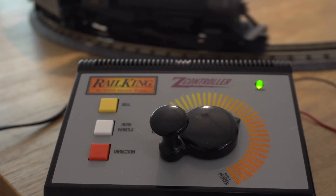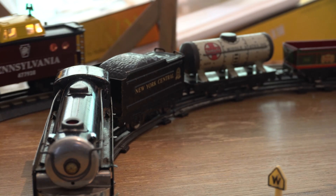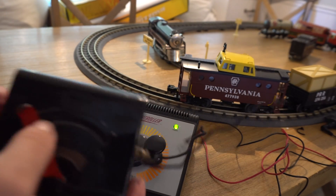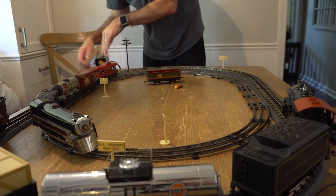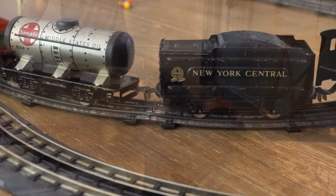Let's try the 1950s train. Does it work? It uses the basic same principle as the other train — a voltage transformer that goes through the tracks to the locomotive. In this case, it's just a motor in the locomotive. There's a light. This 50s train is more dangerous; the wiring standards of the 1950s were not what they are today. You've got bare wire, even on the 120 volt receptacle there's bare wire, but I guess parents weren't worried about their kid getting zapped. Believe it or not, it still works. It's a very simple design, everything works. I had to flip it on and off several times to make it go forward instead of backwards, but it still works. I can actually see — I don't know if you can see the sparks on the camera.